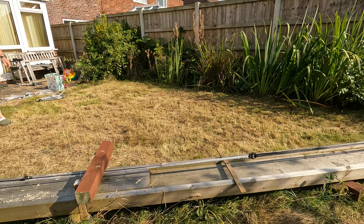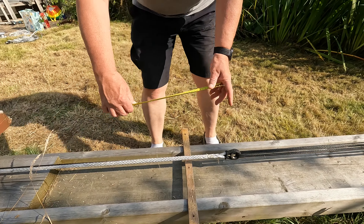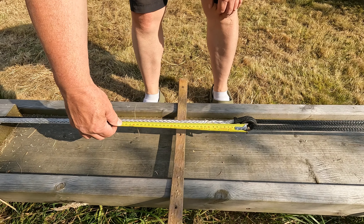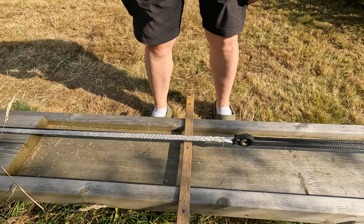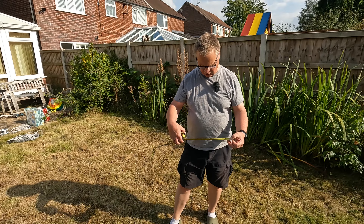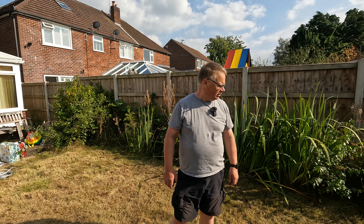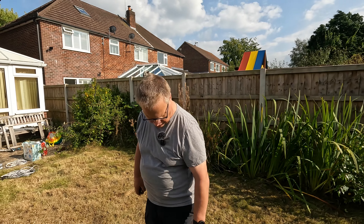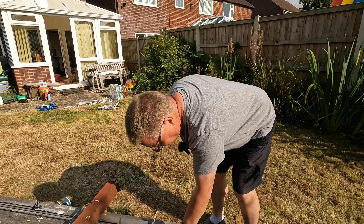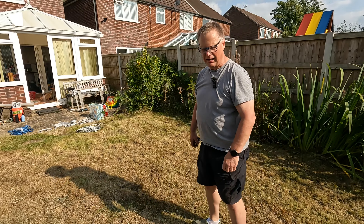Let's get the tape measure and see how far it's moved. We're not entirely consistent about the starting point, but that's 180 millimeters - 18 centimeters, or for old money just over seven inches. You'd never have your shroud that tight on the boat - if we do, we'll bend the boat.